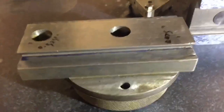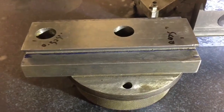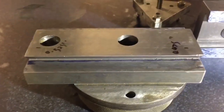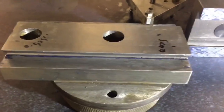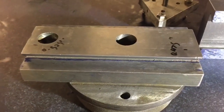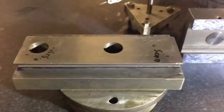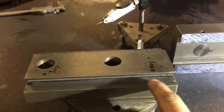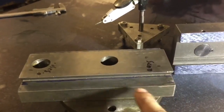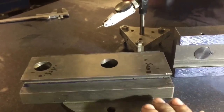I'm guessing the scraper they used wasn't relieved very well and they missed that back section. So when this top slide has been in use, even when it's locked down, it's only sitting on that tiny little strip — not even an eighth of an inch wide — at the back. And this is on the operator-opposite side, so most of your tool pressure is actually down there.